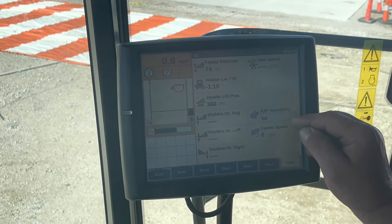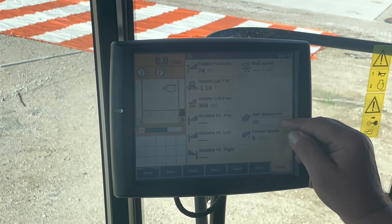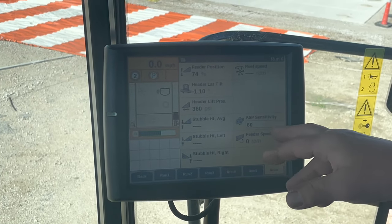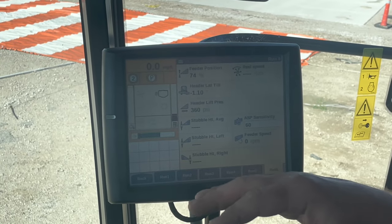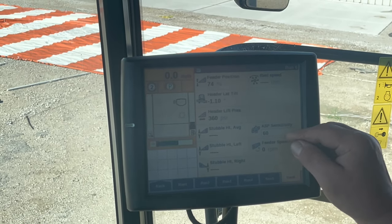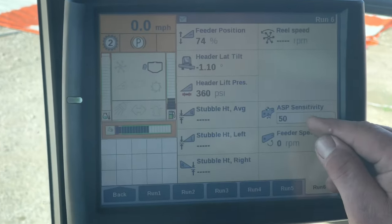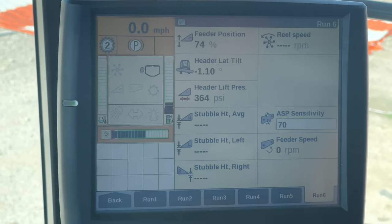The ASP - Advanced Stone Protection - we normally run 60-70% in beans and down closer to 20-30% in corn. On these tier 4 combines like the 60-90 series and newer, we've actually left this set at 80% and run corn and beans with it. The way everything gets amplified in corn, it senses it and won't keep kicking the rock trap open. On the 900 series combines, we're having to run closer to 50% in beans and around 20% in corn. On the newer machines, you can leave it set at a high sensitivity and just leave it alone.